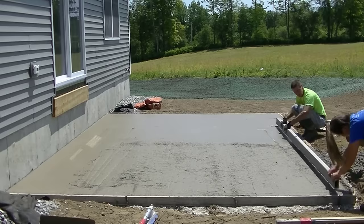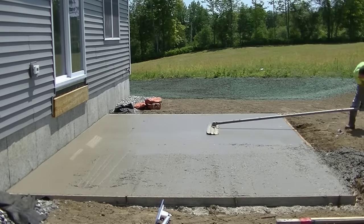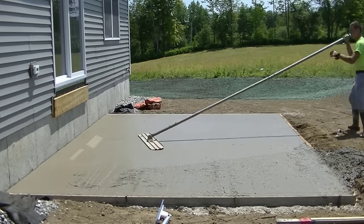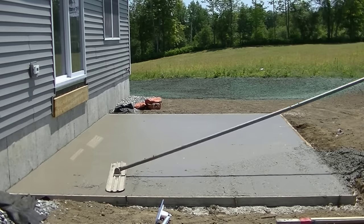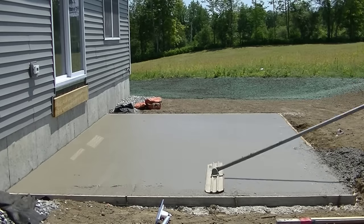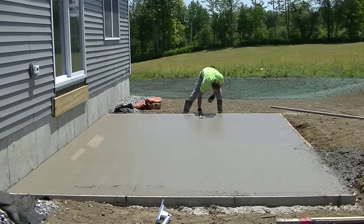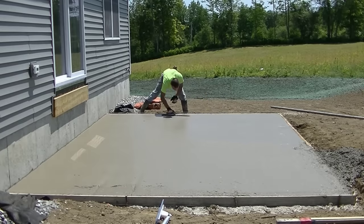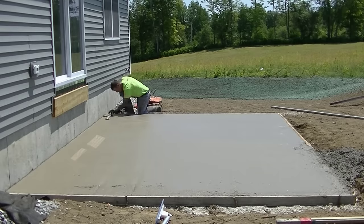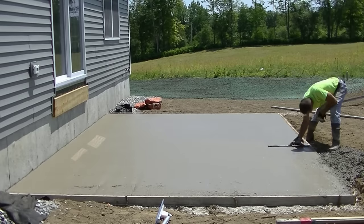We had a little too much concrete — about a half a wheelbarrow too much — so we had to pull it out over the edge. I'm going to get this bull-floated nice and quick, as fast as I can. Like I said, the concrete is setting up a little faster than normal because of the temperature and because the concrete was a little hot when it showed up. Normal concrete temperature is in the 60s, like 65 degrees. When you touch the concrete coming down the chute and you can feel it's warm, then you want to hustle — it should feel cool to the touch. It's really important that you know what you're doing on days like today; that's why it's best to pour concrete first thing in the morning.